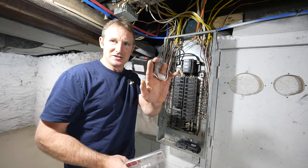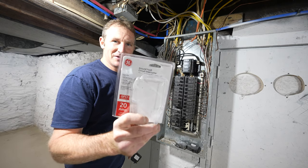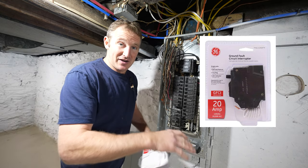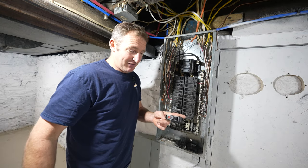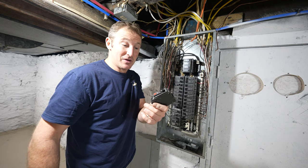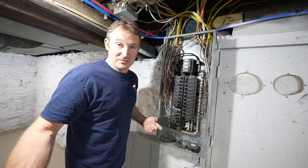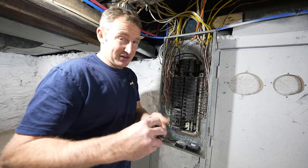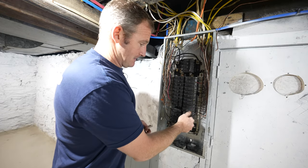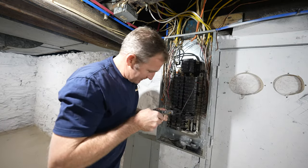So how are we going to make this safe? We're using one of these breakers — this is a ground fault circuit breaker. This would eliminate you having to use a GFI outlet anywhere, so if you wanted to use a regular outlet you could do that, or anything that you want to have GFI protected. This is the way that we're going to make that outlet safe for the bathroom — very simple installation.